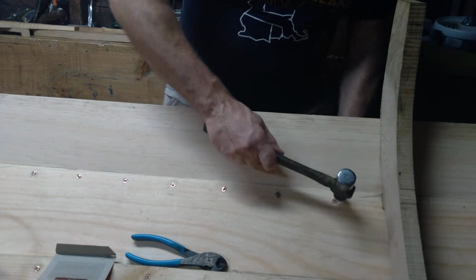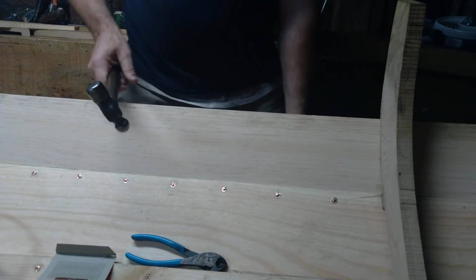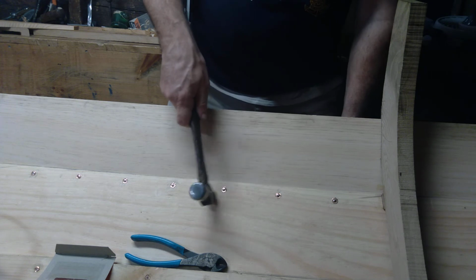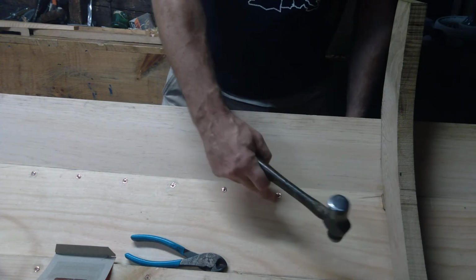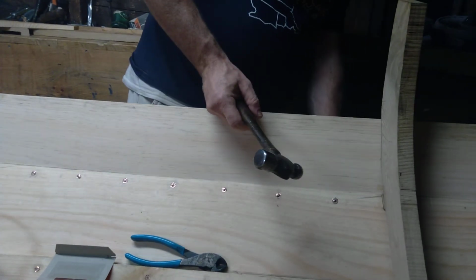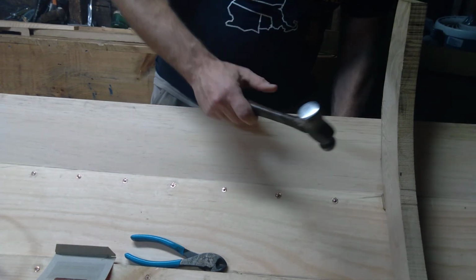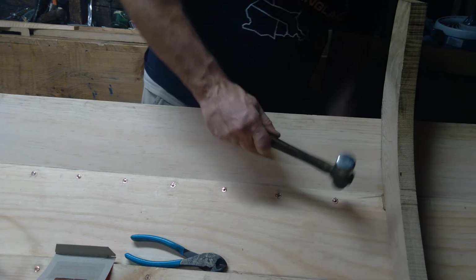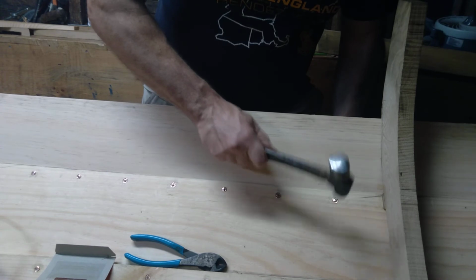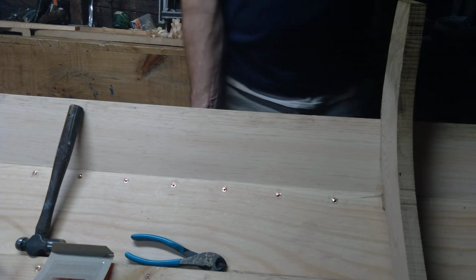And then I'm taking that rivet, taking those factors into account, and gauging how deep I want to go on this plank. Because I want to get as much meat of this plank as I can. I don't want to be fastening right through this feather edge. So I'm gauging how deep I want to go on this inside plank when I drill the hole. All right.